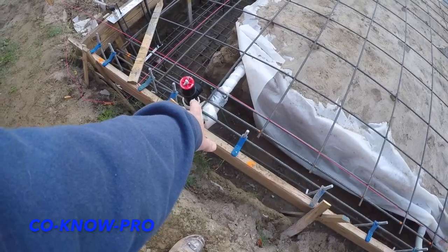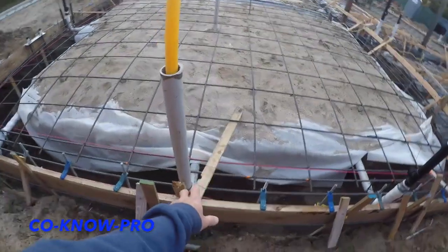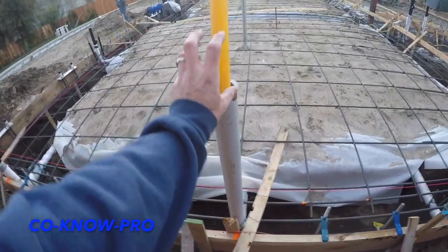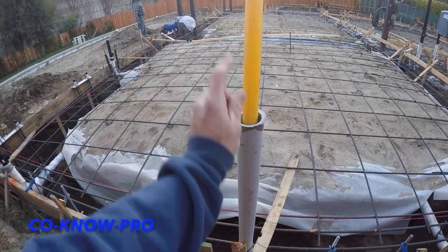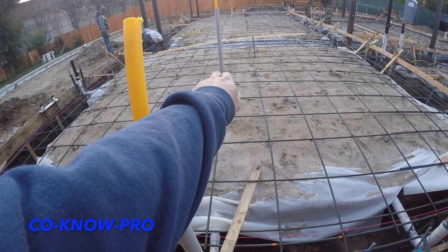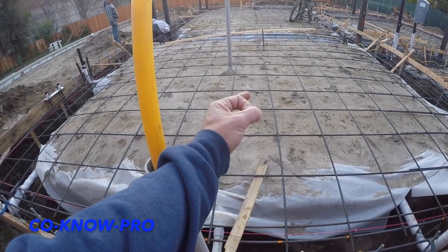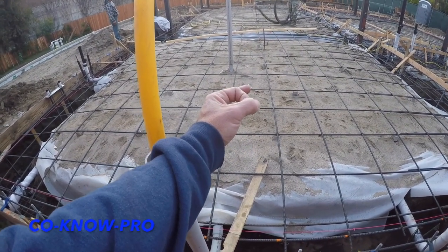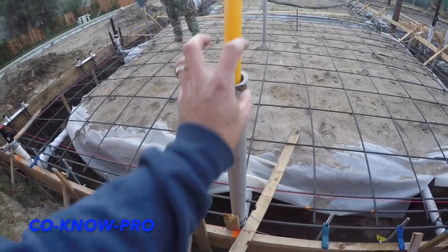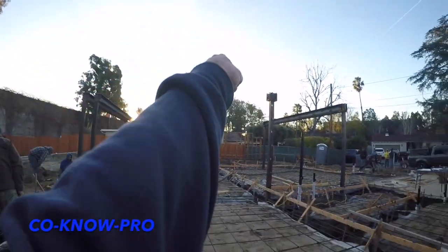This is for our gas line that's going to come in to our island right there. This gas line is going to have a little sanitary tee on it with a little screen on it to vent up any gas that gets trapped in this pipe. That pipe will be cut down flush with the concrete, and then you fill that pipe up with caulking or plaster — whatever the plans call out — to seal it. If any gas leaks in that yellow pipe, it'll come into this pipe then vent out this little tee, and the gas supply will come from overhead on that side of the wall where the meter is.